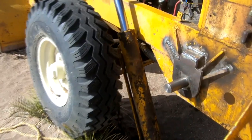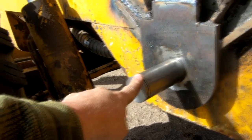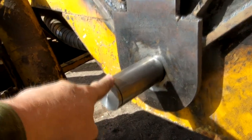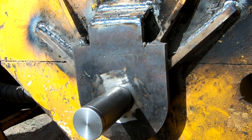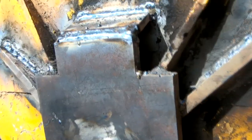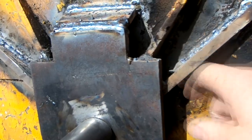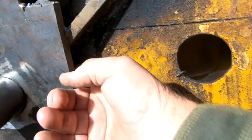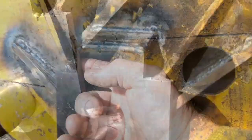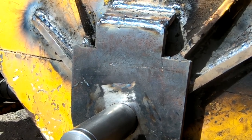It's a couple — actually four days later. I found a local machinist who cut a new pin for us and also cut a new hanger plate. He recommended a local welder who came out and did some welding. Honestly, I don't know what to make of the welding. I asked the machinist to make new gussets to replace the cracked ones, but he just left the old cracked ones on there. It looks like he welded it here and about an inch or so back behind, but given the way this failed before, I'm just not sure that's enough weld to hold it with the amount of weight and force on this thing.